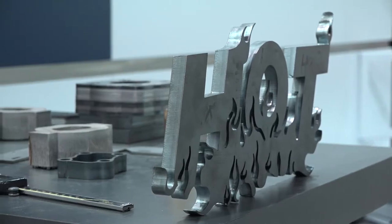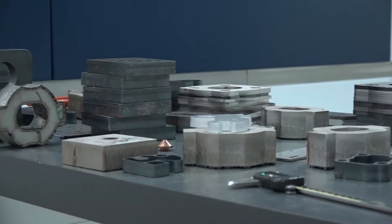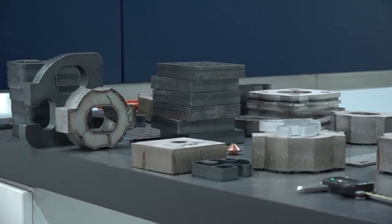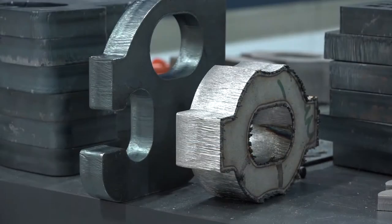All the materials you'll find a laser cutting company supplying: mild steel, stainless, aluminiums — up to 25mm in aluminium, 25mm in mild steel. As we've seen on one of the samples here, we can happily go up to 40mm on stainless. Copper and brass are not a problem. You've sold a lot of these machines in the UK — why do you think that is?